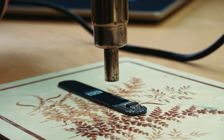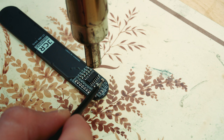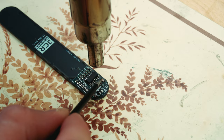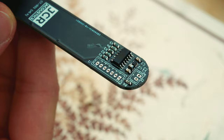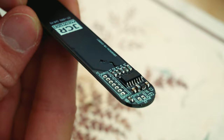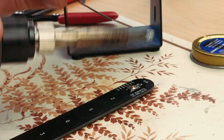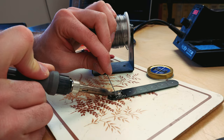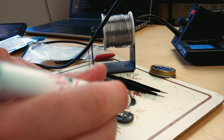Once all your components are laid out, come in with the hot air gun — this heats up the solder paste and you'll see it magically wick towards the solder pads. On smaller components, pads can end up overlapping with solder; just jiggling them can straighten them out, and all pins end up correctly soldered. This is a double-sided board, so on the other side I have a switch to attach and some connectors. I'm using a soldering iron for this because I don't want the hot air gun heating up and causing components on the other side to fall off. I tack it in place with the soldering iron and use a flux pen to make sure the solder wicks properly to the pads, then solder across the rest of the pins without fear of it falling out.